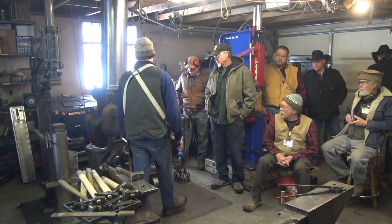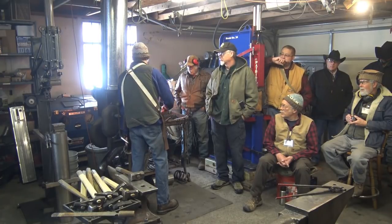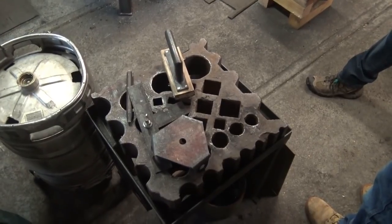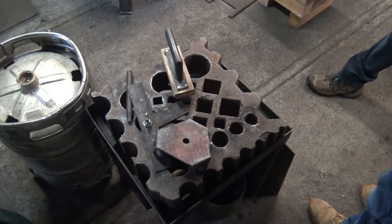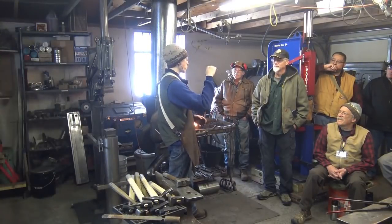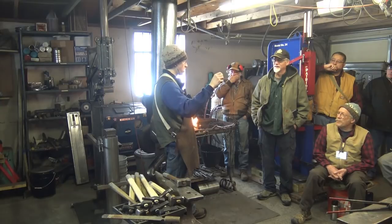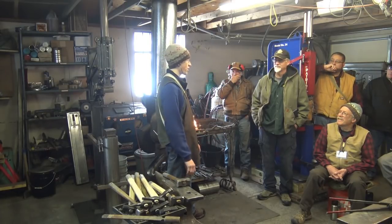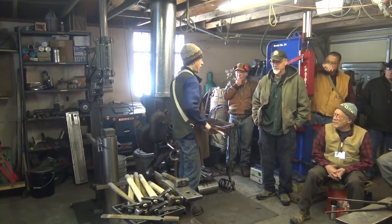But Nucor Steel was more of a metallurgy internship, and I spent the summer working on sheet metal. I was in the hot mill for a sheet mill, which was one of the coolest things I've ever seen. There's nothing like hearing a slab of steel come out of the caster, and then it goes through a couple reheat furnaces that are about the length of a football field. And then there's its 2-inch slab, and it hits that first rolling stand and just this gagoosh. And then it speeds up as it goes through the succeeding 6 rolling stands. So it's just boom, boom, boom, boom, boom, boom, boom, boom. And that sound as you're going from 2-inch down to 1/8 inch or thinner sheet metal is just so cool. Seeing this thick bar sluggishly come in and sheet metal flying out the other end is phenomenal. Really cool sight. If you ever get the opportunity to tour a sheet mill, do not pass it up. It's awesome.